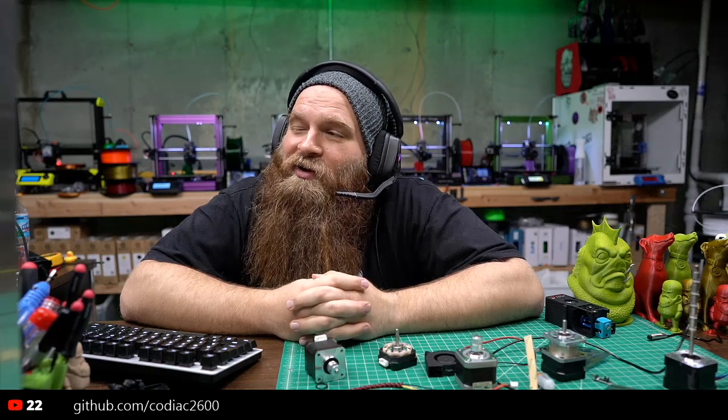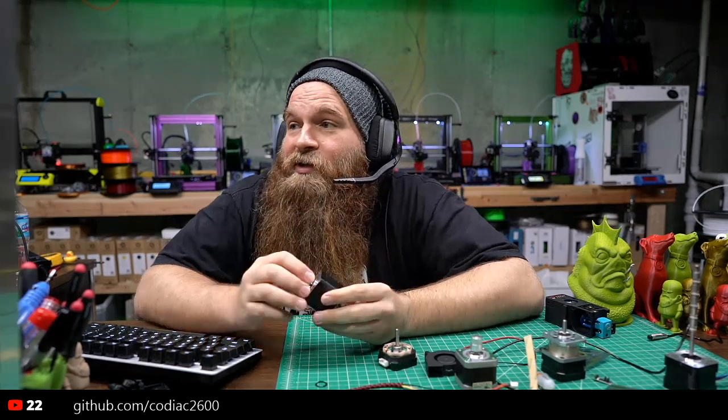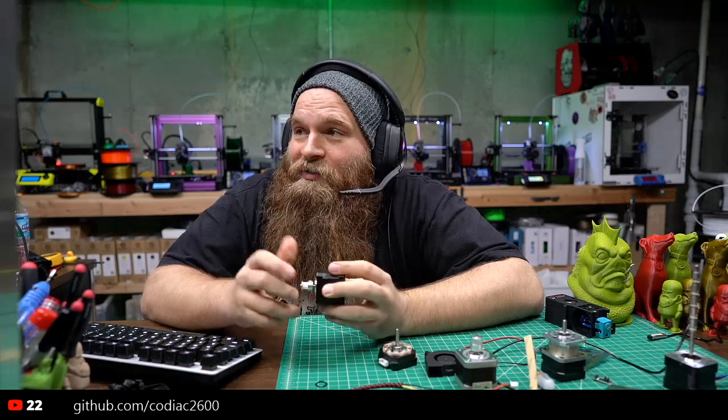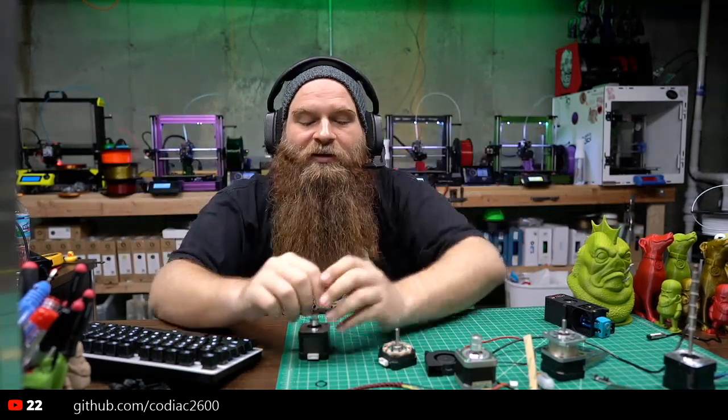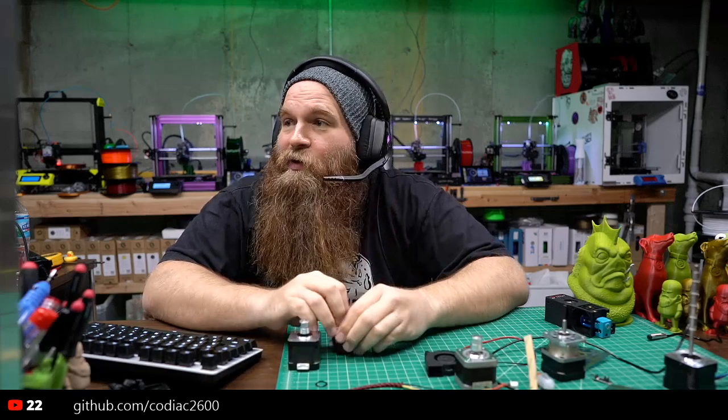There is a lot less in configuration_adv.h, or adv.h, but the settings are a little bit more involved, and you need to know a little bit more about 3D printers and 3D printing in order to get your settings tuned the way you want them to be tuned. So I know Josh has some fancy features on his Tesseract that need some fancy gizmo gadgets done to it.